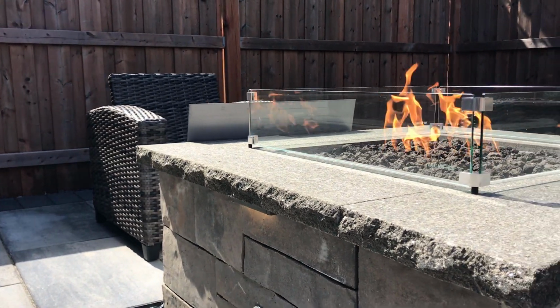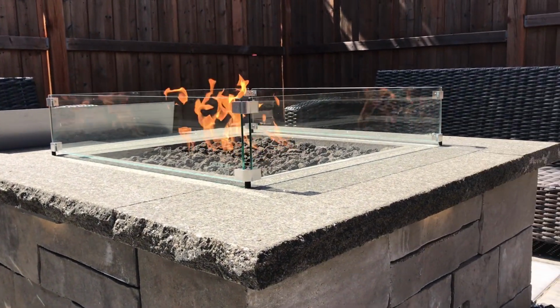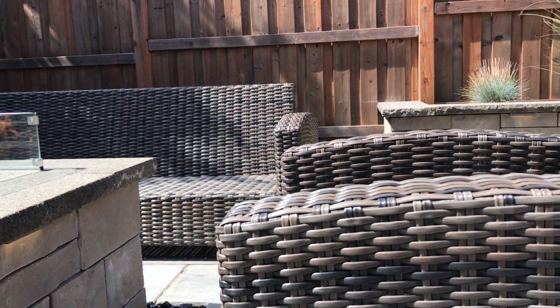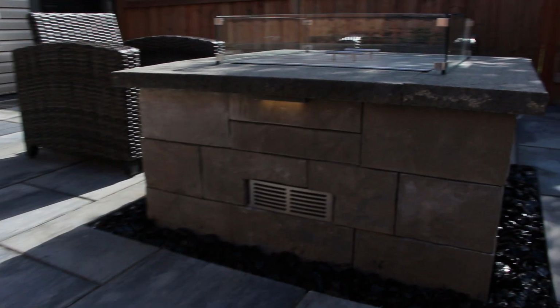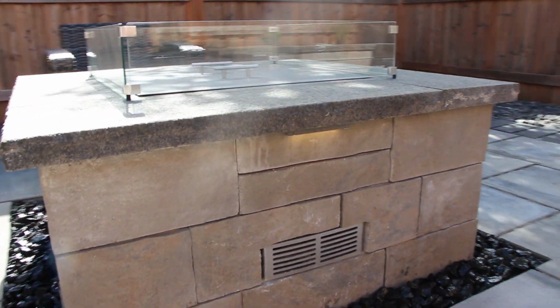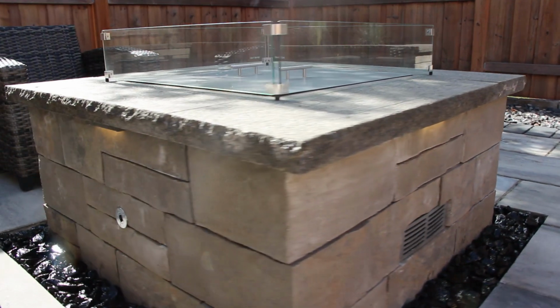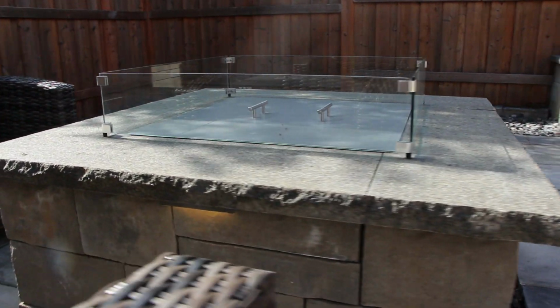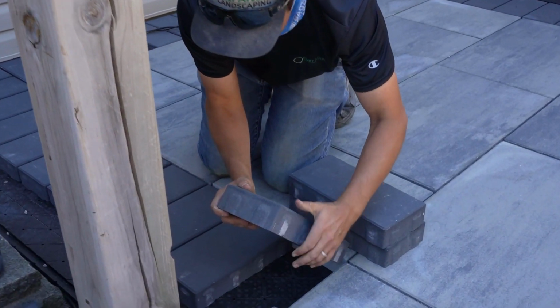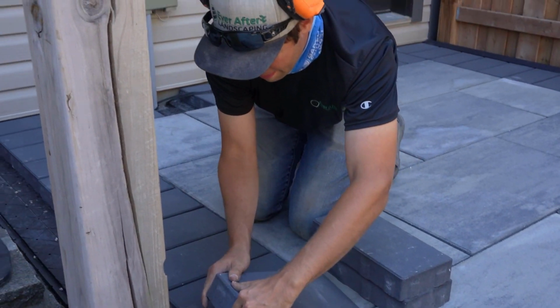Now, if we were going to miter, we would actually have to step this up to 6-foot caps because they don't have the 5-foot caps available in this product line. So then we'd have to go to 6-foot caps. Then we'd have to miter these caps by 4 feet along the long side and mitered at 45 degrees. And that just introduces much more waste than if we were to square these pieces off. And just aesthetically, with a square patio, that just looks much more pleasing to me.